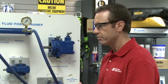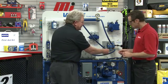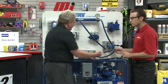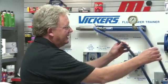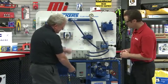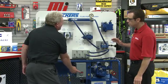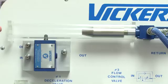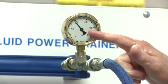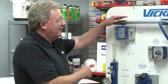Tell me what kind of hoses we've got set up so far. What we have already is the pressure line from the manifold to the directional control valve, the tank line from the directional control valve back to tank, and then the A and B lines to the horizontal cylinder. I'll turn the unit on, and if you'll shift the valve, you'll see the horizontal cylinder operate. Right at 400 PSI — that's the pressure we'll be using today on the horizontal cylinder.